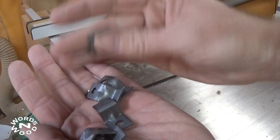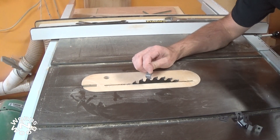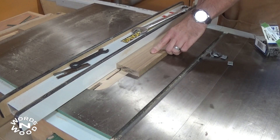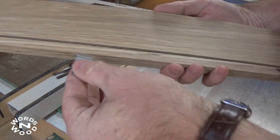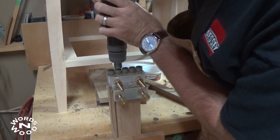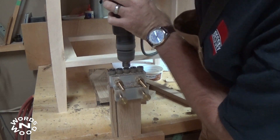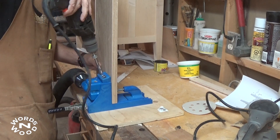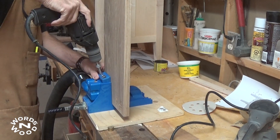These are metal table clips which I'm going to use to attach the top, so I need to cut a dado in the long rails. I'm using dowels to attach the long rails to the leg assemblies. There are no lower rails — the bottom shelf serves as the structural support connecting the leg assemblies at the bottom, and it seemed to make more sense to use pocket holes for attaching the shelf to either end.